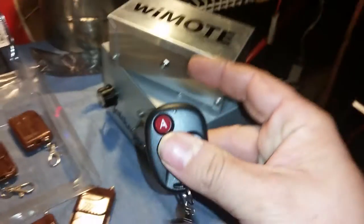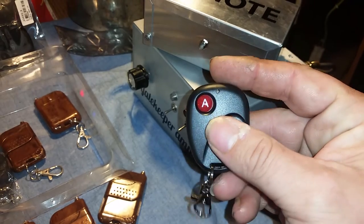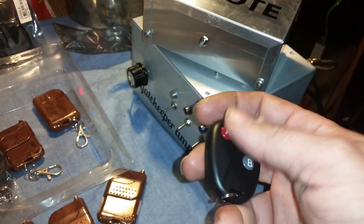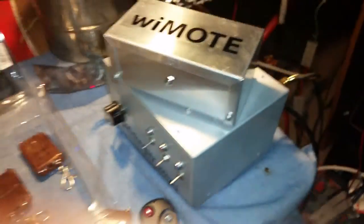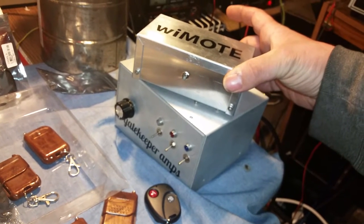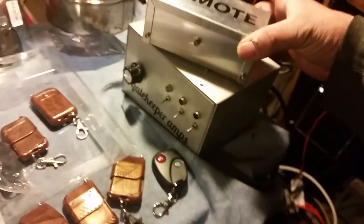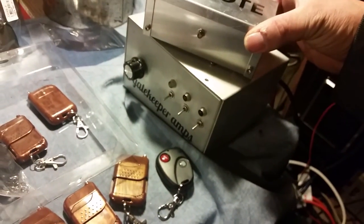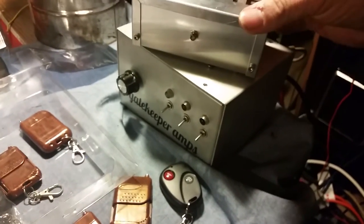All right. So now I'm going to program the remote. And first, I want to create the option to where how I want the remote to work. I want to press A to turn it on, B to turn it off. So now we're looking at the third beep. And this is what I'm talking about now. That's the initial programming beep. Now we're going, that's one beep, two beeps, three. Now I'm letting go. Okay, that programmed how the remote's going to work.